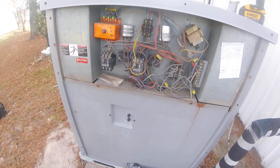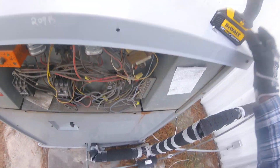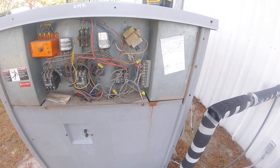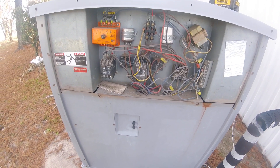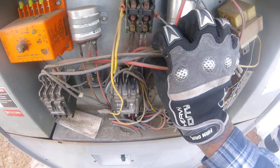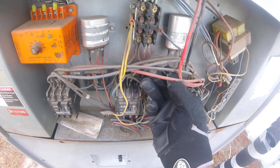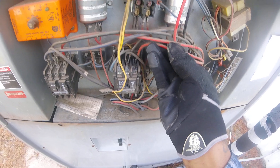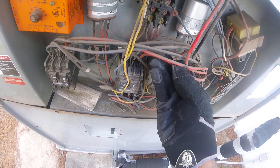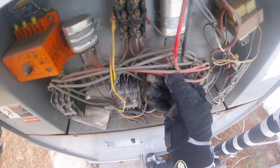See what we got here. I'm going to go ahead and hook some gauges up to it, see if I got some pressure. I'll be honest with you — I got that contactor fried back there. Look at that. That's a problem right there. This piece broke off — looks like it broke off from right here. It probably broke off because it was close to the 24-volt wiring right here. I bet it broke off and maybe hit that 24 volt and blew something out.